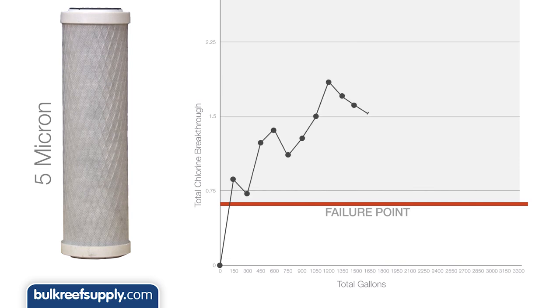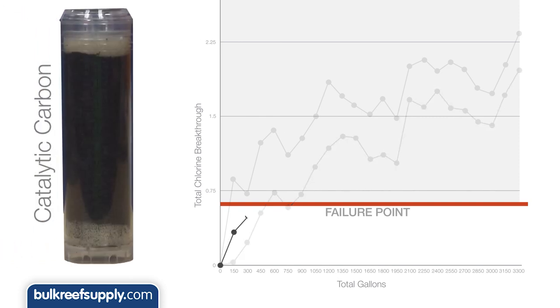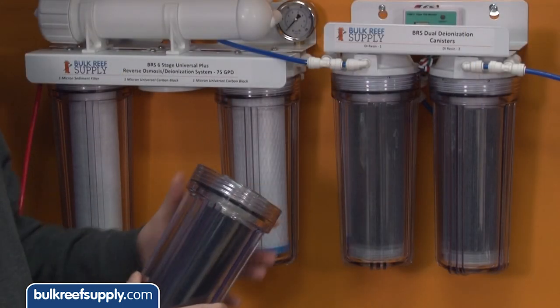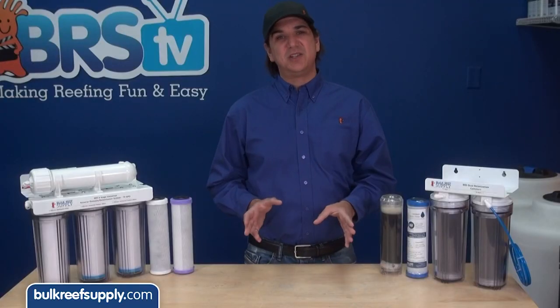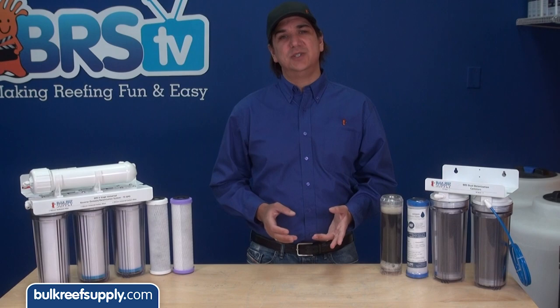The amount of chloramine making it through the filter also rose rapidly even at slower flow rates. Ultimately, even though the filter is one of the most widely used and trusted filters for chlorine, it is of very little value treating for chloramines. The 0.6-micron carbon block performed better and made it to day four before hitting the 20% breakthrough failure point, but quickly lost performance afterward. The refillable catalytic carbon cartridge performed almost identically to the 0.6-micron carbon block at these flow rates, which was somewhat unexpected but probably related to channeling. The refillable catalytic carbon is commonly used to reduce chloramines prior to the more costly specialized carbon blocks because it is considered less expensive and has a lower pressure drop.